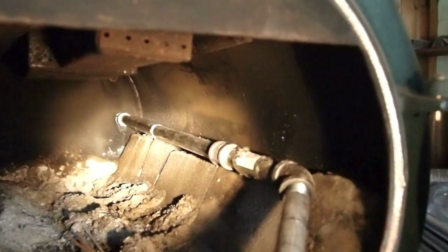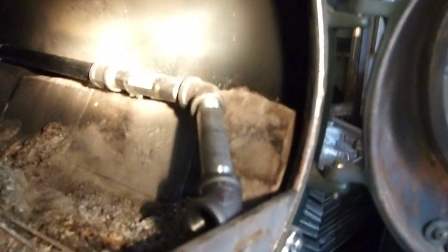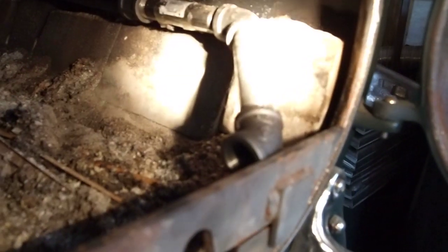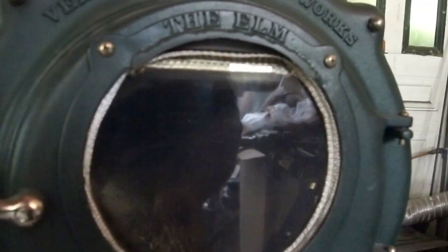This is preheating the air through a series of pipes, elbows, 45-degree fittings, and things like that, and it ends up right there at the inside of the air wash. When you want to get the fire started with new logs or starting from a cold situation, you open the draft and give it essentially unlimited air until it's going the way you'd like. Then, when you go to the low burn situation, you simply close this.